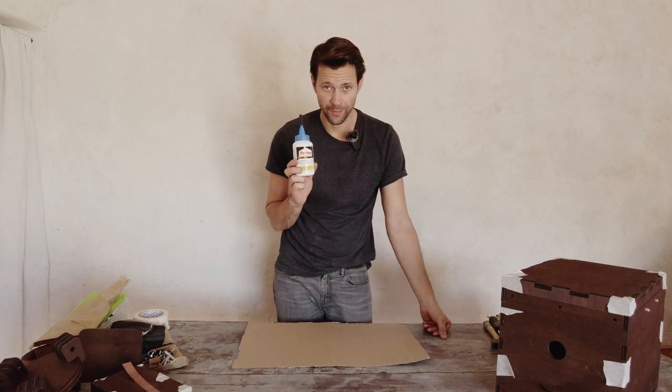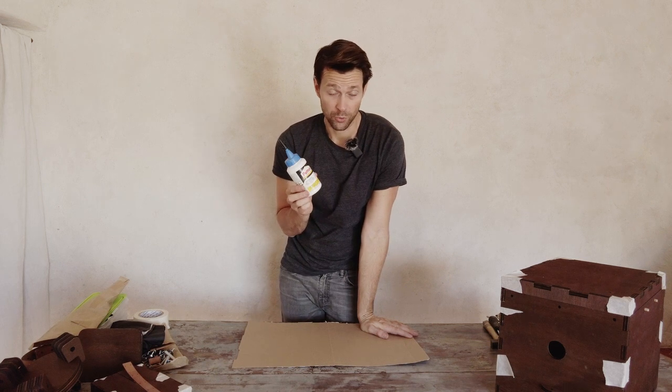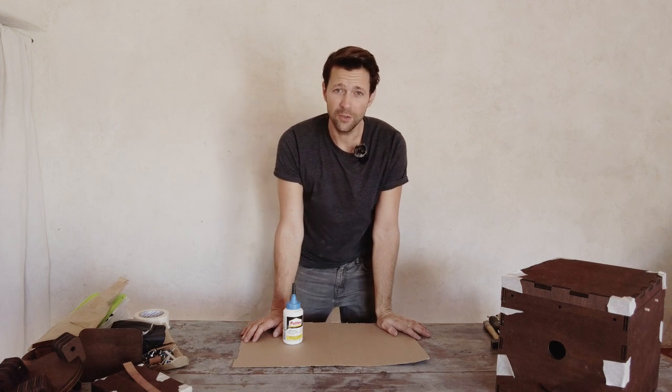What do we need? Wood glue. There are different types — this is just your regular white wood glue that you can buy anywhere. There's also PU glue — polyurethane glue — called differently in different countries. The difference is basically that PU glue expands a little bit, versus regular wood glue which tends to contract a tiny bit because it's water-based.